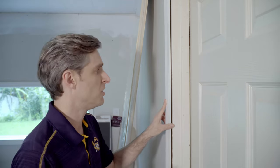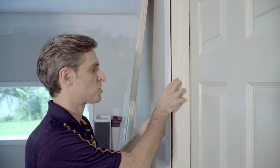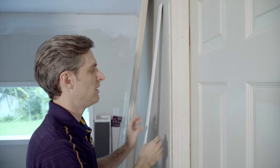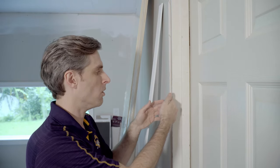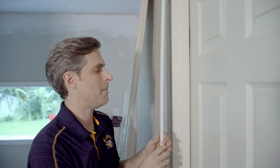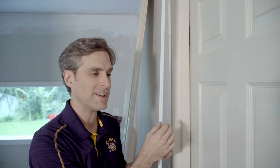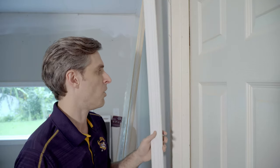The solutions I could find online were to take a razor knife, clamp the molding to the wall, score your edge on the outside, remove it, and actually remove the drywall to the depth of the casing. While that works, I didn't care for the look because it meant the molding was recessed into the wall and less of it was showing.